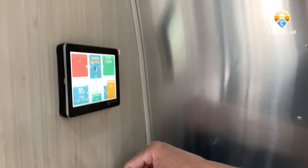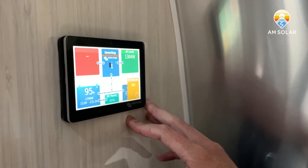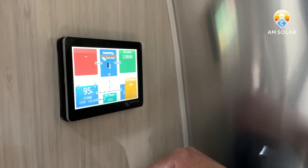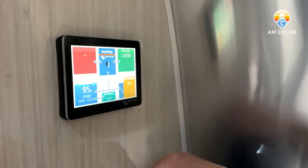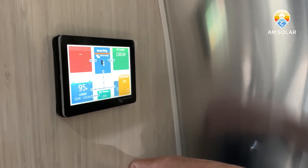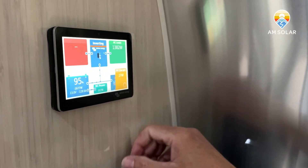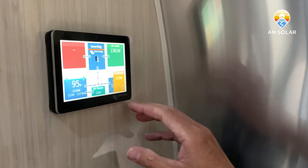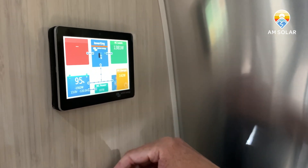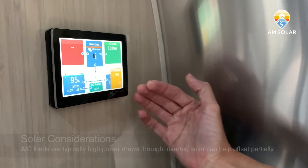The PV charger says zero watts. As soon as we get the solar panels back on, the MPPT will recognize there's daylight, activate its charger, go into bulk charging, and we should see this number climb up pretty well. We've got a 400-watt system up there. As the solar slowly climbs, there's a threshold of around 30 to 35 watts where the dots start to flow — anything less and the dots don't flow, but once you reach that wattage output you'll see the dots on the icon flowing power from the charge controller to the batteries.